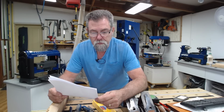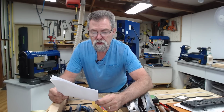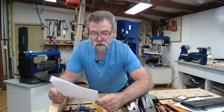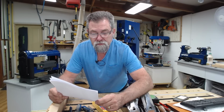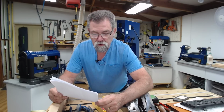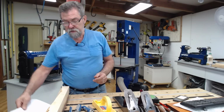The WA CALM department published a scientific paper report suggesting the UF glues, urea formaldehyde, work well with Western Australian timbers. I tried that for a period, seemingly with success. But 10 years later, I was repairing furniture glued with the UF glue joints, and re-gluing with epoxy resin. Golden rule for Jarrah, nothing but epoxy resin. Well, Ian, thank you very much for letting me know that.